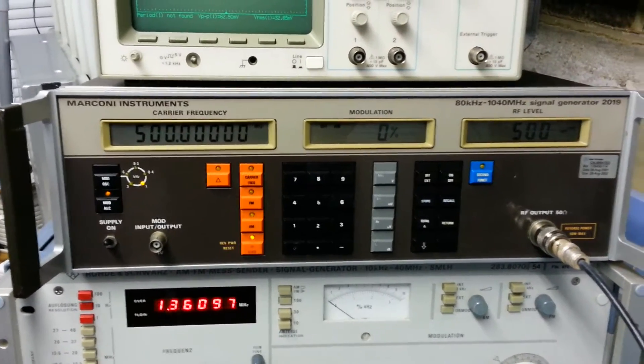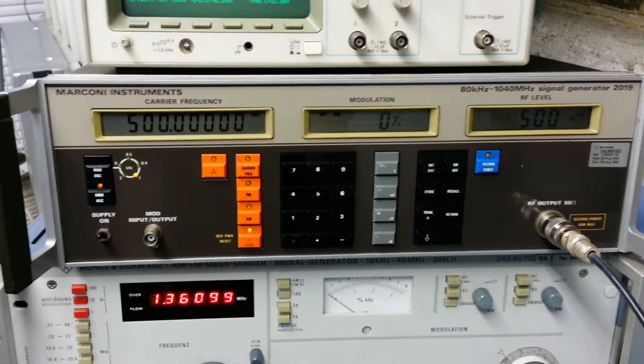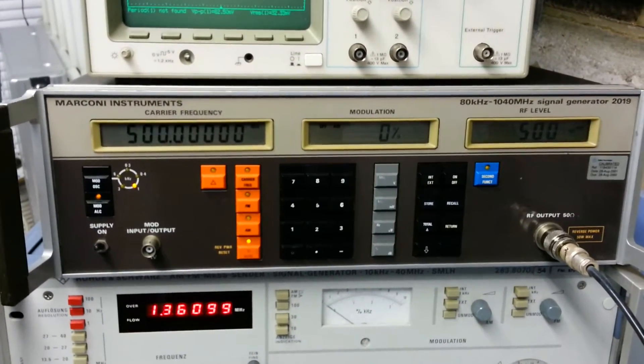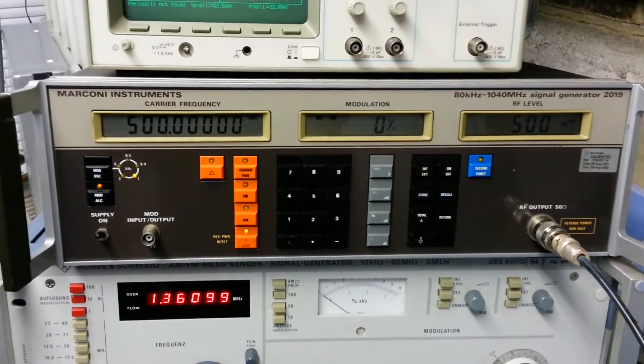I think it's C3, and it's 100uF 35V. This capacitor had leaked electrolyte and had burnt through the board and taken out two tracks that controlled the buffer to the keyboard, so therefore the keyboard was inoperative.